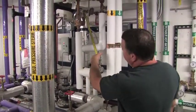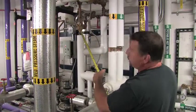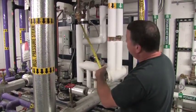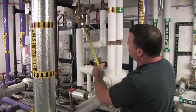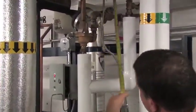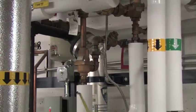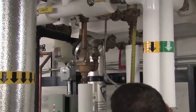It's 190 degrees here. This is a heat trap. It drops down to 190 here. This first stage mixing valve, which is a non-electric thermostat, basically like a truck thermostat. It's a blending unit. It takes cold water in the bottom, 190 degree water in here, and it knocks it down to 160 degrees at the outlet. We then go to a secondary valve, drops the unit from 160 degrees to 140 degrees, which then hits our mixing valves. So we have a primary thermostat and a secondary thermostat.